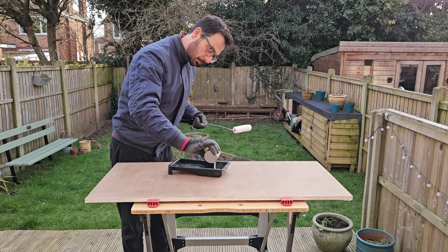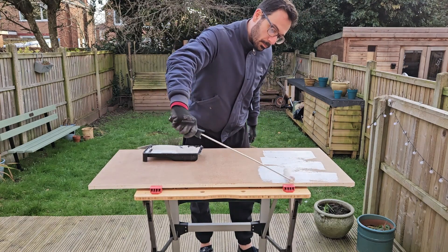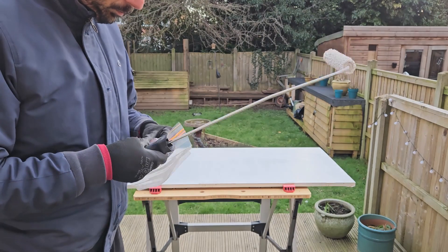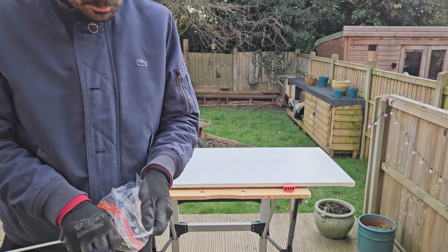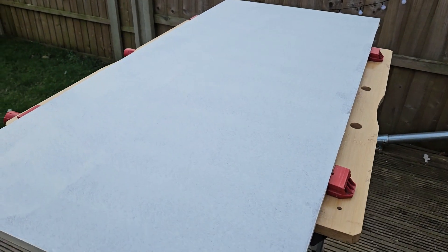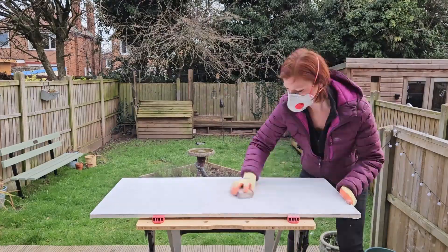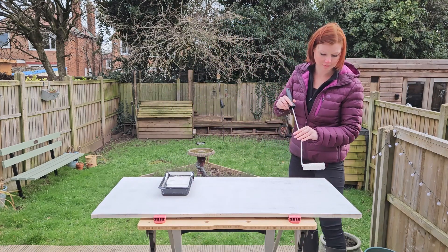Always stir and always prime your rollers — make sure they're coated. Apply thin and even coats. Keep your coats thin, not too patchy. Between coats you don't need to wash your rollers every time, but do keep them airtight so they don't dry — that's fine for a few hours, possibly even till the next day. As you can see, the first coat is thin and smooth but a bit patchy — but that is better than one thick, goopy coat full of air bubbles. Always smooth it off and clean it up. Use the longest roller possible for the job.